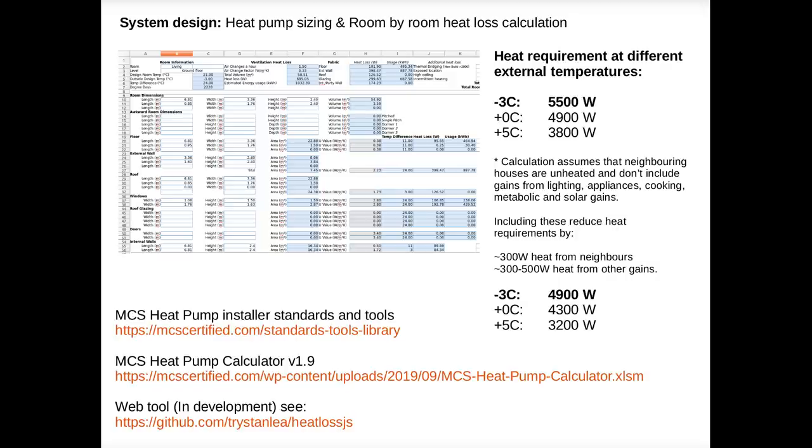From previous experience with heat pumps I was aware that the smaller heat pump has a lower minimum heat output, which can help provide better efficiency during warmer times of the year. This choice has worked well — we haven't had any issue with not being able to deliver enough heat. It's worth noting that the 5 kilowatt heat pump has ample capacity for the heat load at average January temperatures, which are around 5 degrees outside, giving a heat load of around 3.2 to 3.8 kilowatts — well below the 5 kilowatt capacity.